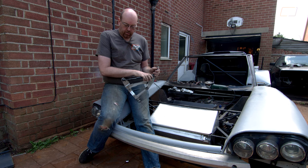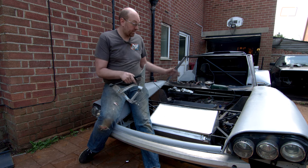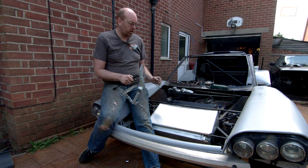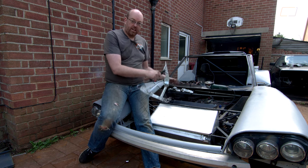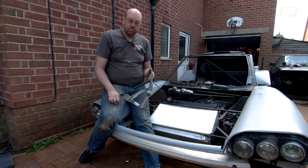These have little gas rams on the front, but we're probably going to move the gas rams further back because the bonnet is very long and not hugely stable at the moment. We don't want it to bend at the midpoint — that's the weakest point. It could flex if there was too much force with the gas rams right at the front.